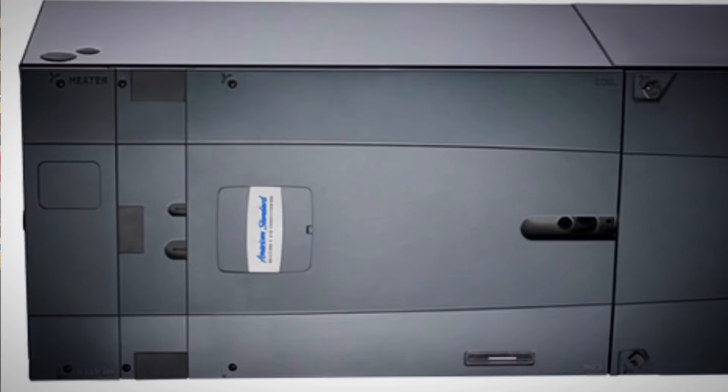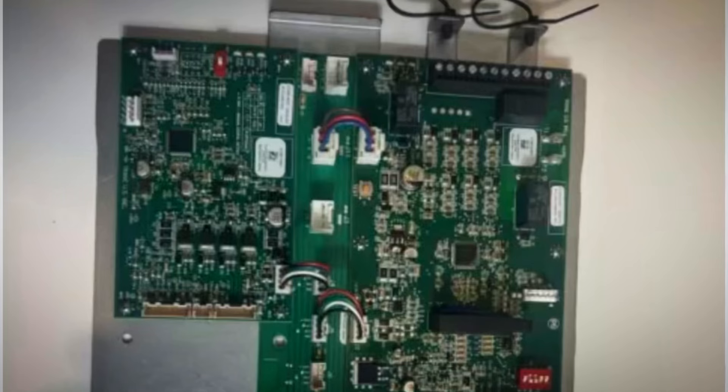It was easier for me to just go buy an air handler. For that amount of money, I could actually afford to go buy the TAM7 Hyperion air handler, which was perfect for my situation because I was dealing with an R22 outdoor unit. Even though it was in great condition, it was still R22. Those air handlers had a dip switch that allowed you to switch from R22 to R410A and back based on what refrigerant you needed, since it had an electronic expansion valve. That allowed me to pair these things up, and it was such a close pairing it really didn't make much of a difference.